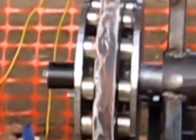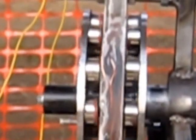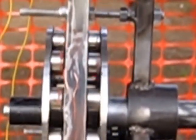So when this thing gets up in the air and mounted on the pole, it should be putting out some pretty decent power. I'm going to go ahead in a bit and try to wire up the setup. Now this is AC output — I don't have it going to a rectifier yet. It's spinning up pretty good. You can see the spacing between the stator and the magnet rotors. Those are 49-pound-pull magnets, one inch diameter by half inch thick. I've got about an eighth inch to maybe a sixteenth inch gap between the magnets and the stator. I'm pretty happy with the results so far. I had to take off the upper stator protector — that little arch piece that Belgrade mounted on there. If this puts out good, I'll make another set just like this and send it to my buddy so he can test it on one of his wind generators.